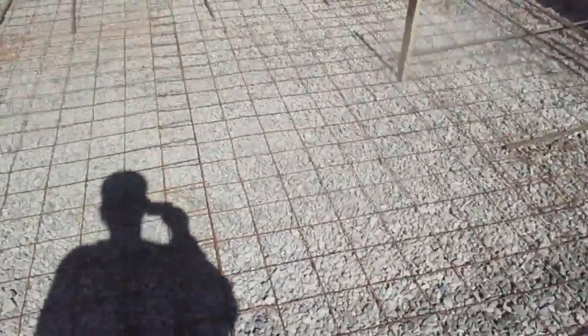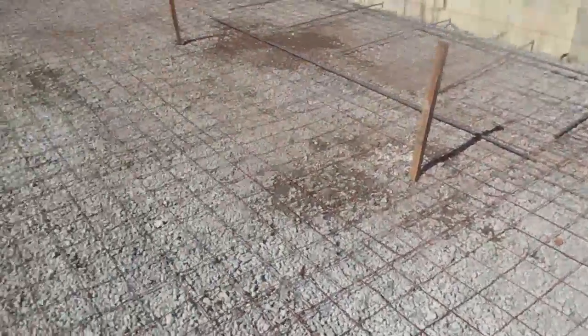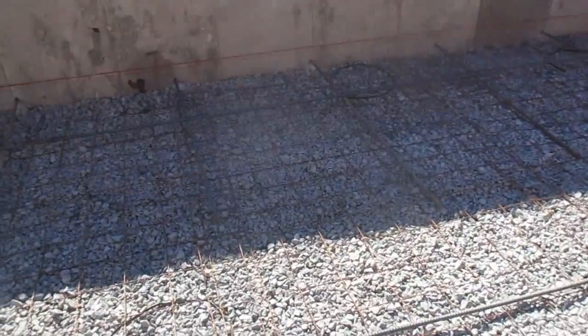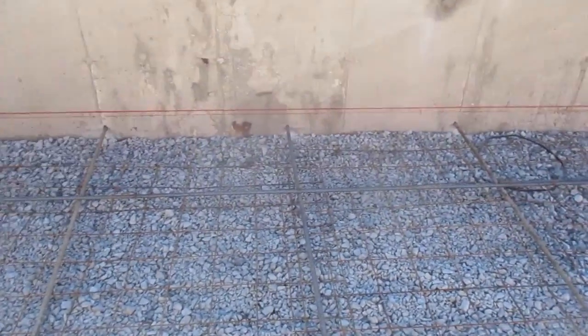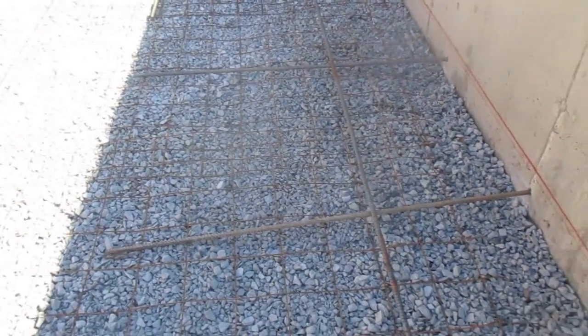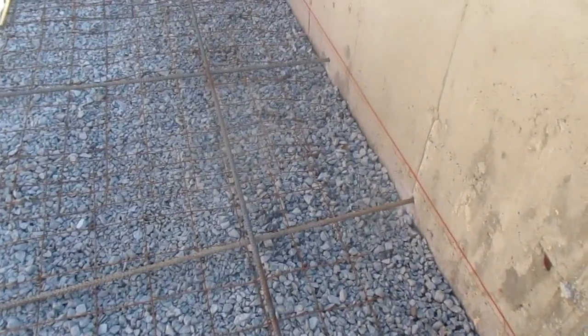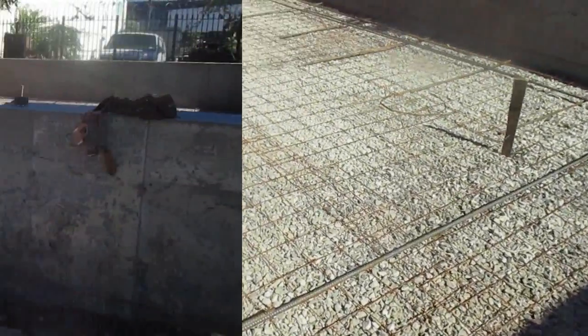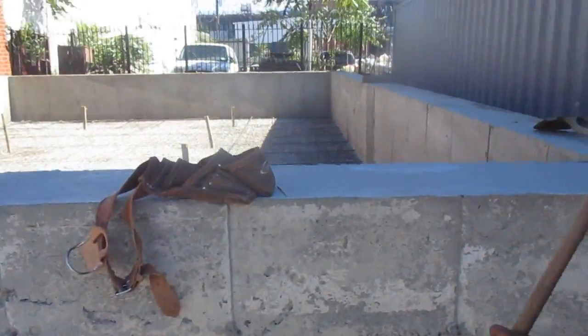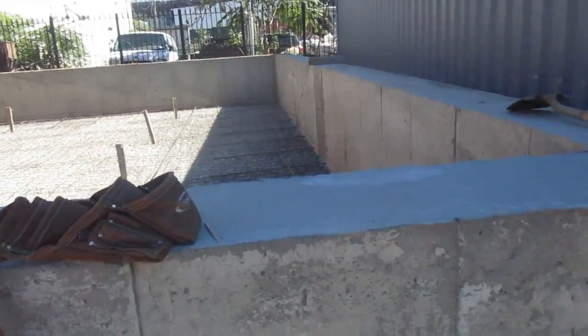Then you put the wire. This gives you a nice clean cut piece of rebar straight across. What you're doing is actually transferring the weight over the entire length of the rod, rather than having all this pressure sitting on a 5-foot piece of steel — you have all that pressure sitting on a 30-foot wide piece of steel, or however wide your slab is.